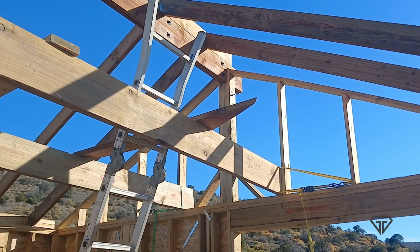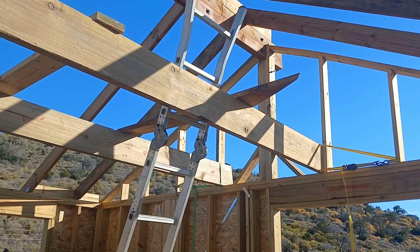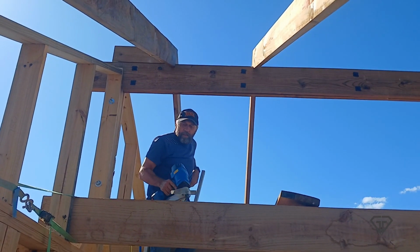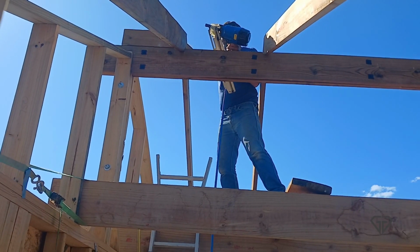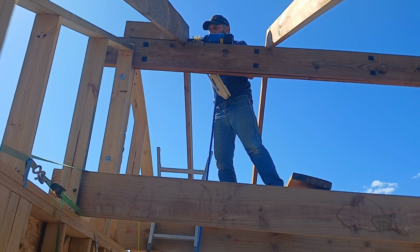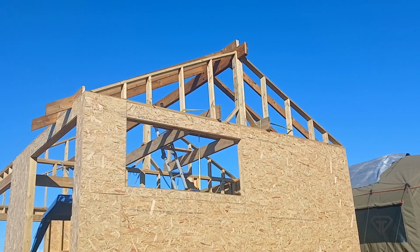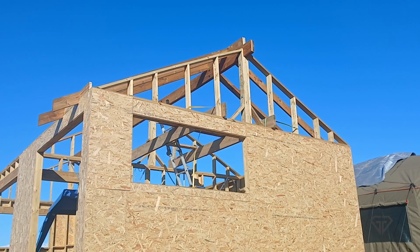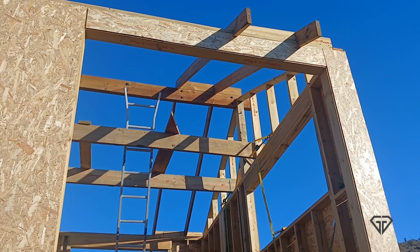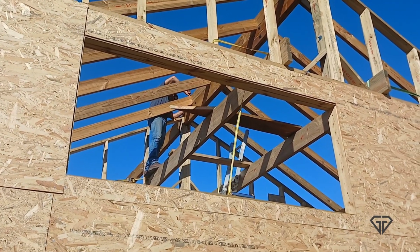For one part of the house, that is the bedroom section, I could rest two beams over the wall sections and fit some off-cut wood to form a scaffold on which to stand while I'm fitting the rafters. This plan worked well for the first 5 rafters, that is the bedroom roof.